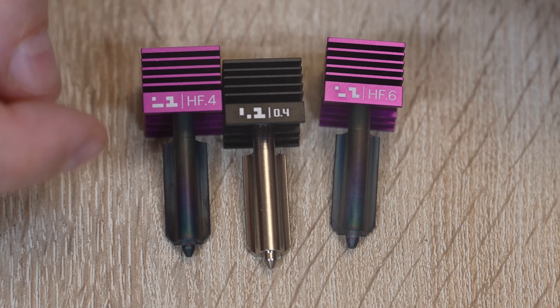With the 0.6mm nozzle it's a little bit different. The bigger diameter is always harder to heat up and to maintain higher flow, and here I could experience a significant difference and advantage of the high flow hotend compared to the regular standard Bambu Lab nozzle. There are a few things I couldn't really measure — like less sticking of the material to the nozzle, wear resistance (theoretically both are wear resistant), durability (this should be more durable), and the maximum temperature. Theoretically this can be heated up to 500 degrees Celsius, but we have the limitation of the printer — 350 degrees for example on H2 printers. It can really benefit in the future on printers which can be heated to much higher temperatures. Just a reminder: hardened steel nozzle will become soft if heated up to 400 degrees Celsius and slowly cooled down — that's one of the annealing types for steel. So yes, I definitely think this is more durable.